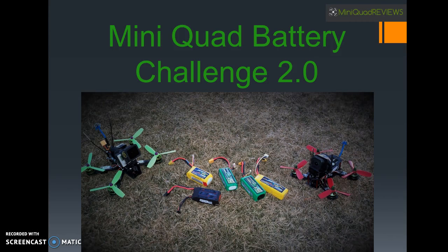Last year, the batteries we had were more for bigger quads, 250, 280 size, so it was more like 1.8, 1.6 4 cell, 3 cell batteries. Now that I'm flying more 210, 180 size, I've changed my battery size a bit. And now we've got new players with better quality and more C rating, which really reflects what they advertise on their website.